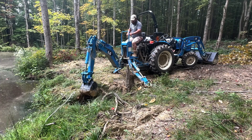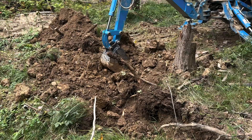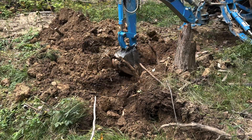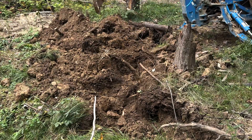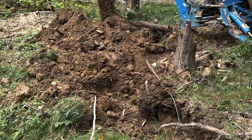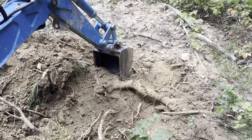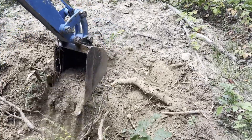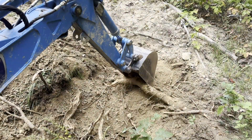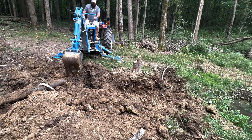As you can see, I'm starting to dig about six feet away from this stump. If you've used a backhoe before, you can tell when it's having a little bit of struggle — you can feel it. So if you feel it starting to catch and grab a little bit, don't be afraid to let up on it. This root here — you can see I started way out and had to find a thinner spot to break it, working my way out on that one.